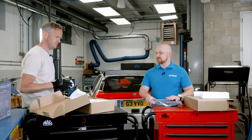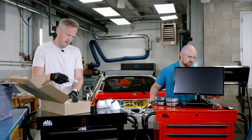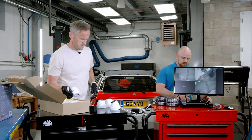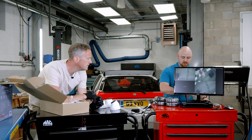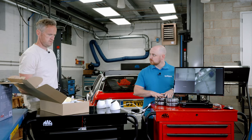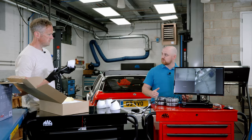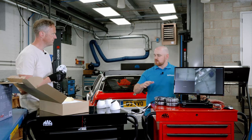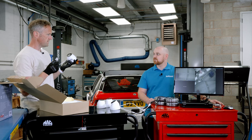A little longer than a few minutes later... right, so what have we got here? I'm going to turn it on. We're actually working — turn it on now. I've got three cameras plugged in. Oh wow, there we go! So we've done a simple install: on the back you've got your HDMI cable from your NVR to your monitor, power to your monitor, power to your NVR. Then the bit we were talking about — ethernet cables. On this one you've got four LAN ports at the back, and you just plug them in and they're working. You do a basic setup for your account — your name, your admin password — but it's really quick to set up.